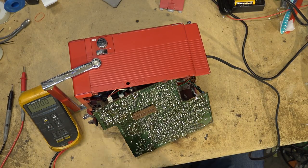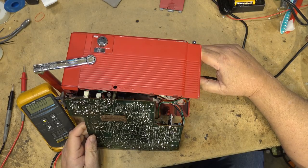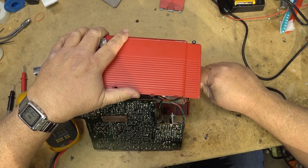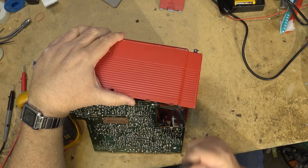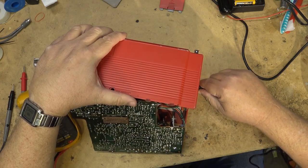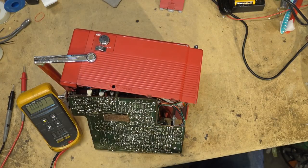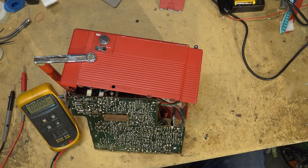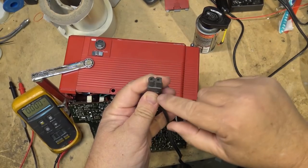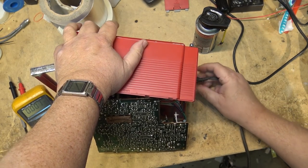Now what could cause a problem on a power supply? It could be the transformer — unlikely, we can hear it humming. But there's a bridge rectifier in here, and there's also switching for whether it's got batteries or AC power. Sometimes if you put the wrong power cord in — which I may have — we're not going to activate that switch that changes from battery power to AC power. So it could be something as simple as not plugging in the right cord. This one uses a polarized cord — the same cord that Sony uses. I'll try a different one and see.